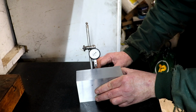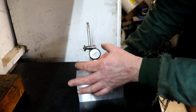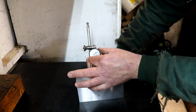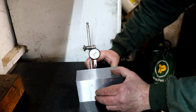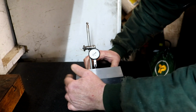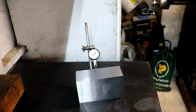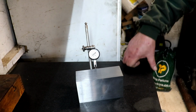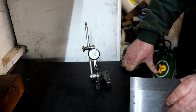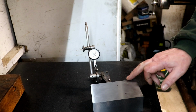And then, oh, it's me, I've touched the back of the surface gauge adjuster. It's not the best surface gauge in the world, this one, to be honest, but you use what you've got, don't you? So we're just a tad over there. So 0, 0. Alright, let's spin it again. Smack on 0. Right, well, for an old grinding machine and area house plumber, I'm quite happy with that. When we lay this block down, which we tested before, this is perfectly flat, you know, when I run the test indicator on it.